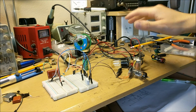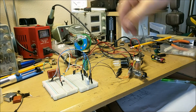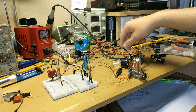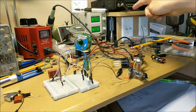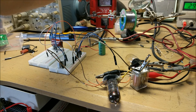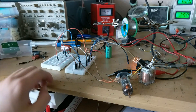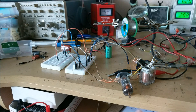This is the practical application — the original prototype. As you can see, I have my capacitors, neon light bulb, vacuum tube, relay, and incandescent light bulb, everything kind of scattered along my desk on breadboards connected with alligator clips. Let's fire this up. I'll first turn on the filament power supply, which is about 6.3 volts. After the filament in the tube is heated up, we can fire up the circuit by turning on the variac. Now as you can see, the whole circuit is warmed up — the vacuum tube's warm, all the capacitors are running, everything's fine. The light bulb is flashing on and off, and you can hear the relay clicking with the light bulb.